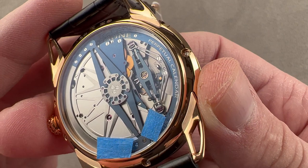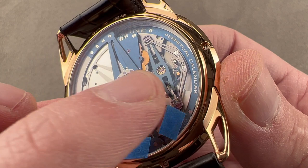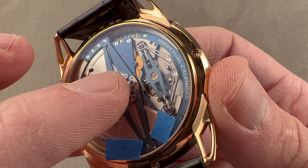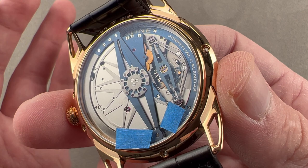You can see that the balance is made of platinum masses outboard and a titanium yoke. The yoke itself is non-annular — it's not a ring — it's more like a cruciform profile or battle axe horizontally opposed. Think two double-sided battle axes horizontally opposed — that's exactly what you have here. The idea is to limit the effect of temperature on timing and also to put as much of the mass of the balance outboard as possible for better resistance to concussions and knocks that can change the timing of the watch.